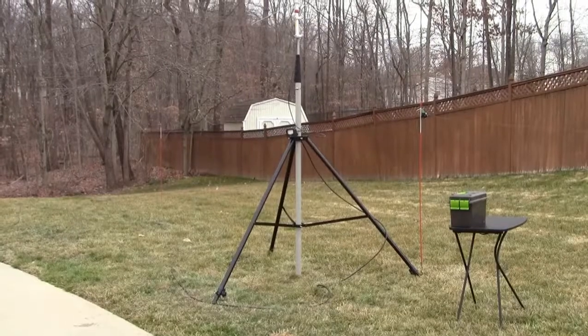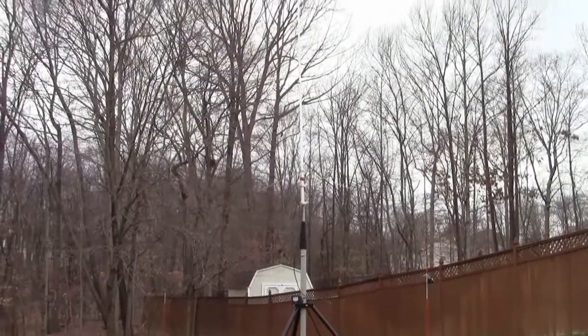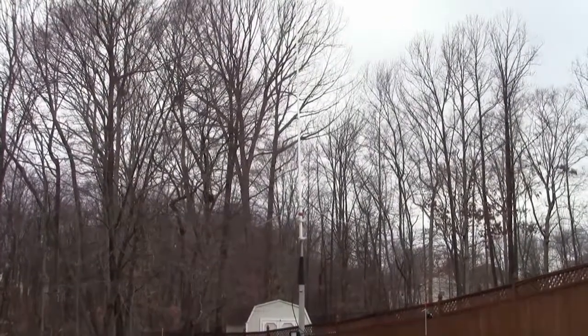What we're going to show you today is what the cost is of using a lower-performing cable — the actual RF output to the antenna. We're going to be doing tests at the output of the radio and at the input of the antenna at the end of a hundred-foot run of both the RG8X and the LMR400. This will demonstrate the principle of decibel loss and show a real-world example of the energy cost when you use a lower-performing cable.